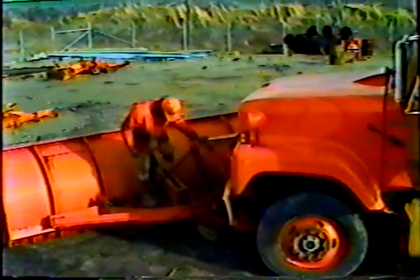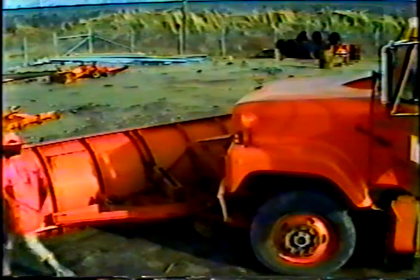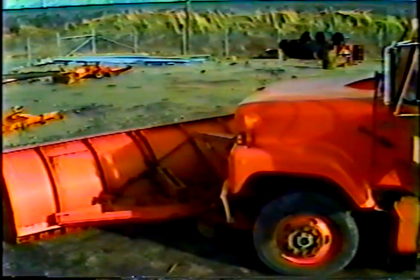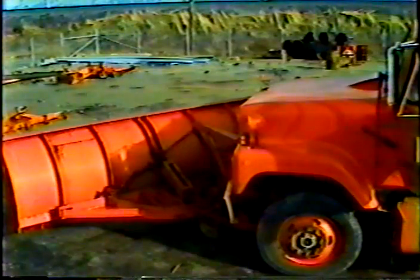Next, connect the lift devices and adjust them so that both ends of the plow lift up at the same time. If the plow you're mounting has a chain like this one, just look for the link that has a lot of wear on it. That's where the plow was hooked up before. And you probably won't have much adjusting to do if you hook it up there again. Of course, if the link is really worn, get a new chain.